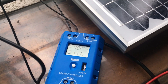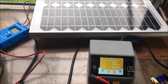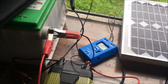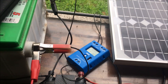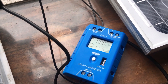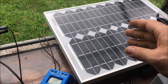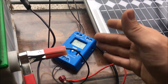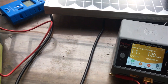We're at 1.1 amps and still 11.7 volts. This is going to work for me. In maybe another month — or even sooner — I'm going to get a 100-watt panel, ideally install it on the roof with wires coming down, and have multiple batteries connected together for more capacity at the same voltage. Six minutes in, we're still at a steady 11.7 volts, so it's really not depleting the battery.